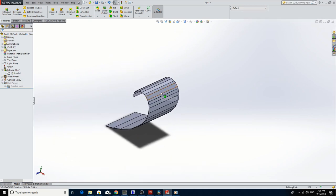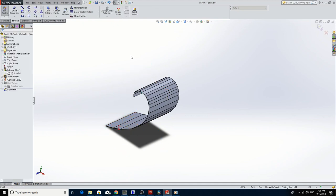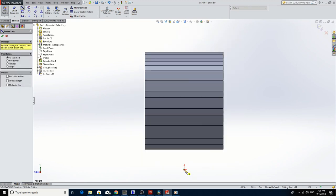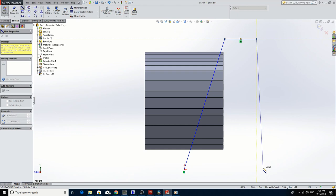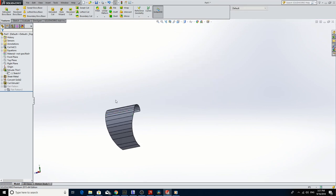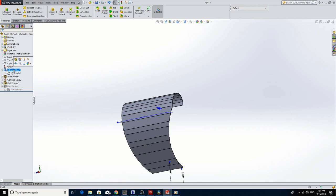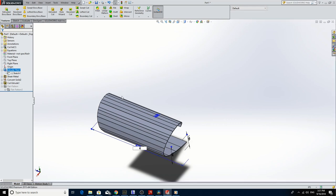We're going to take it back to its original shape and do an eight-petal radial pattern. I need to cut through the horn — picking the plane through the right center axis of the throat. Now looking directly into the horn, we're cutting a whole section out. The horn needs to be a bit wider, so we go back and adjust the first feature to make it eight, since it's going to get cut anyway. Then we mirror the cut on the opposite side — going to Mirror, picking the middle plane, selecting the cut feature, and clicking okay. That's one piece of the petal.